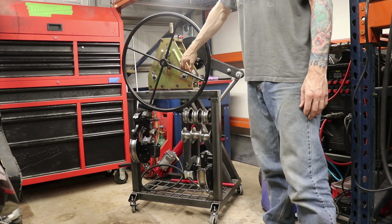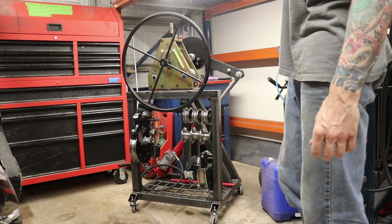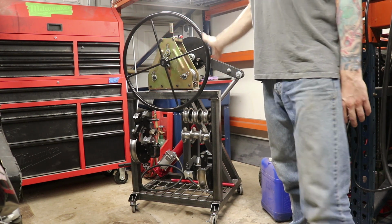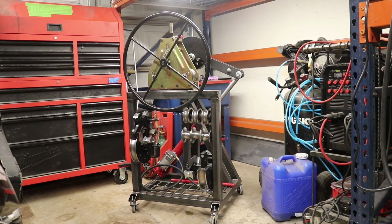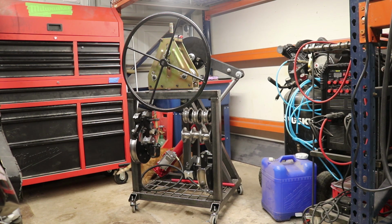It's possible it might be easier to buy a whole separate one, a better one. I don't know, but those are some modifications I can do to this thing in the future, and I very well would like to. Because I found that if you're bending heavier gauge tube, like I'm bending stuff that's 1/8 inch, 0.120 gauge wall, that's what I did for this frame on the chopper, this tubing roller could not handle that. So lighter gauge tubing, I'm sure this is fantastic for that. And this would work no problem, but for the heavier gauge stuff, really a pain.